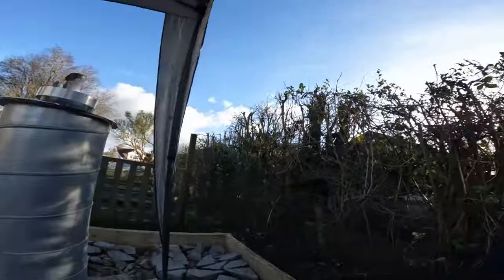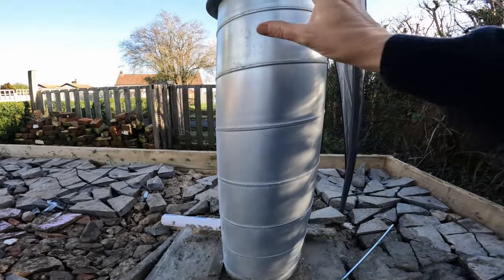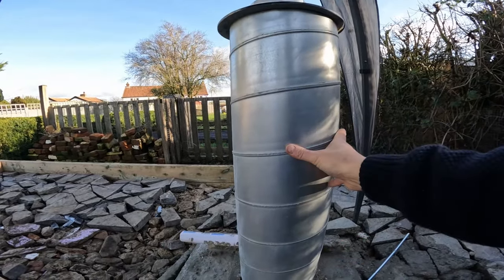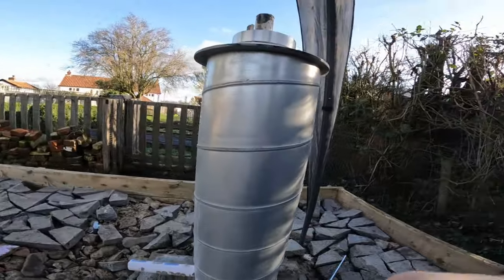I've gone for a four-to-one concrete mix — a very hard, strong mix, the same as I used in my last pier. All I've got to do now is cut the pipes to the right length so they're not protruding, feed cabling in, and paint the steel tube — I'll clean up the dry cement, undercoat, and then paint it black, most probably Hammerite gloss black. I'm going to polish up the pier adapters and stems so everything's nice and shiny. I'm really pleased the piers are both in, and the next job is to prepare the ground and get the slab down.